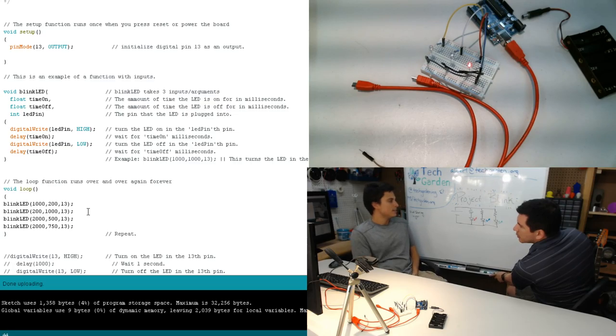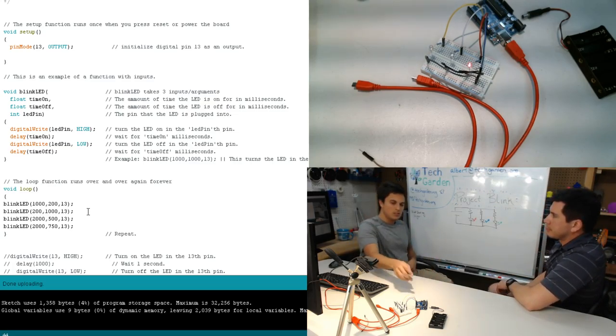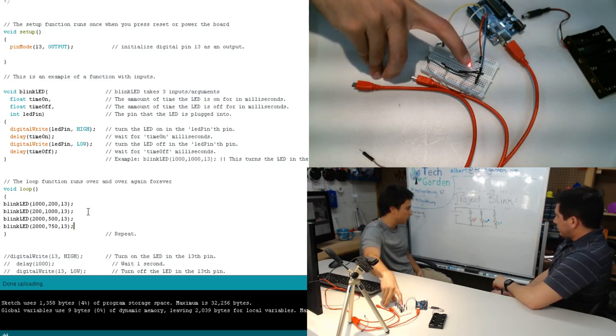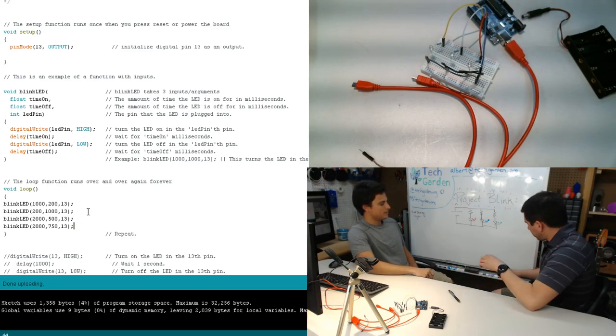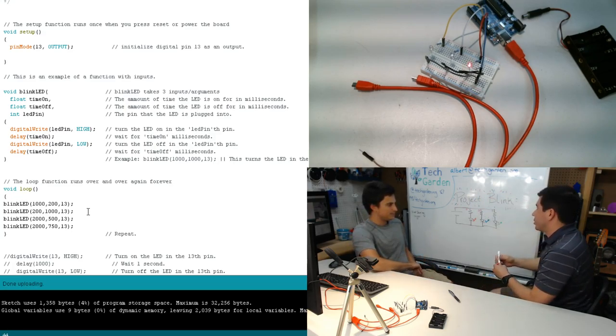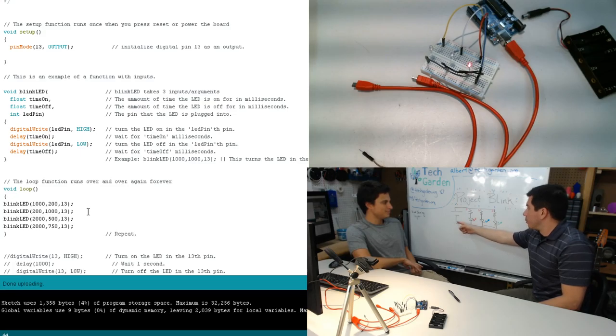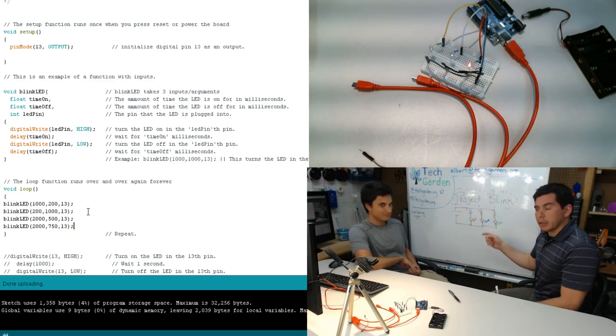Oh, great. So I've drawn three resistors here in parallel. So resistor one and LED, resistor two and LED, and then resistor three. So this would be pin 13, this is pin 12, this is pin 11. And all this is pretty much showing that we are supplying a voltage to one LED, another one, or another LED through pin 13, pin 12, or pin 11.